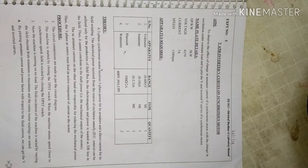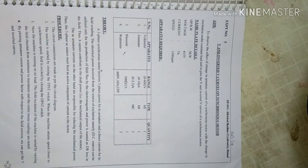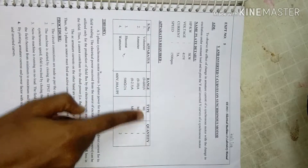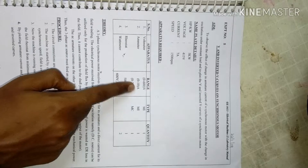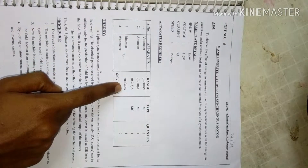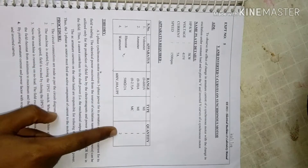In this experiment we are going to see about V and inverted-V curves on a synchronous motor. The apparatus required are a voltmeter (0 to 600 volt), ammeter (0 to 10 ampere), and another ammeter (0 to 2.5 ampere), one rheostat 500 ohm about 2 ampere, and one wattmeter 600 volt, 10 ampere, UPF, two.